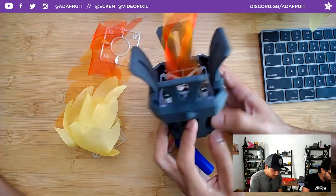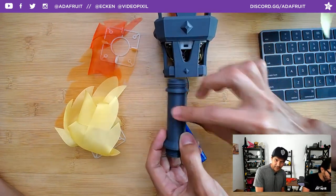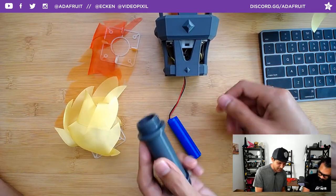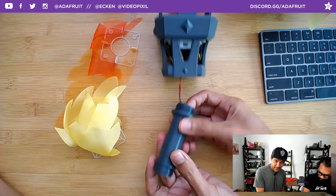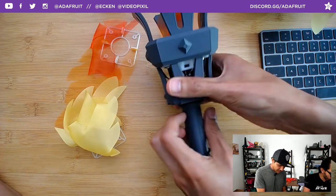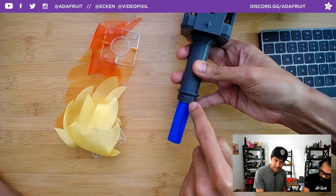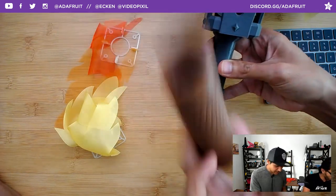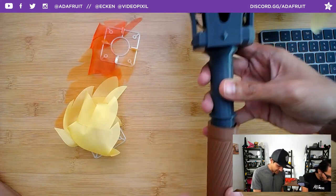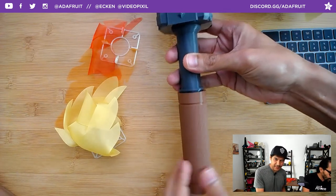Let's assemble it back together. What's cool about this is you can flip it around — it doesn't matter, there's just a bigger flange on one end. Let's just fit that there — fits in nicely. Righty tighty, lefty loosey. Get that nice and tight. If you're interested in how to design these coils, I have a little layer tutorial and there's a playlist we tend to link in all the videos. There's also another one covering how to get designs to match up with some offsets in your tolerances. The knurling effect here on the handle — I used the emboss feature. It's a great way to add not just detail but actual functionality like a good grip to whatever you're designing, and the emboss tool made it so much easier than having to set up coils and sweeps and figuring out the circular pattern.